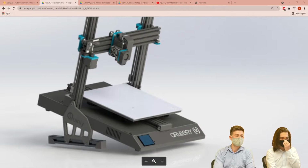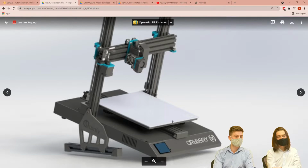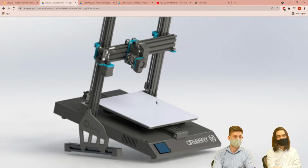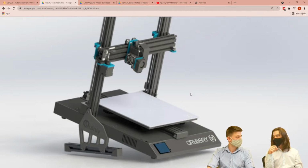So we were talking about the tilt, and reliability is the number one thing when it comes to designing this. For every piece of kit that we add to the printer, we have to make sure that no matter what part you print, it doesn't get caught anywhere, or the chances of it getting stuck are very, very low. We don't want automation to decrease the reliability of your machine. And that takes a lot of work and design thinking. How do you get the printer in this orientation? How do you account for almost any shape part tumbling off that print surface in a way that doesn't interfere with the machine? These machines are not built for parts to come off without someone just picking them off.